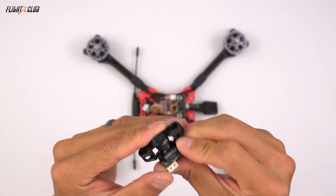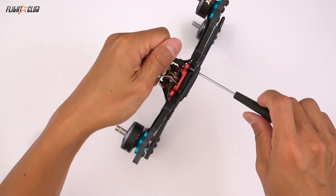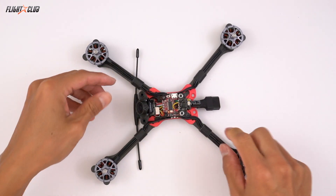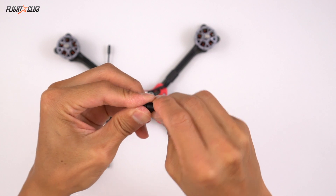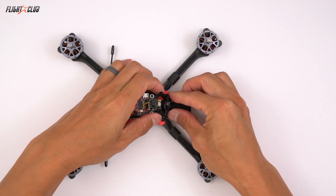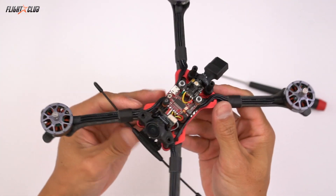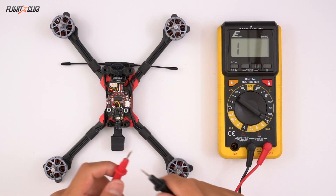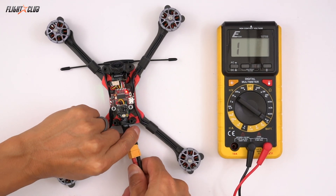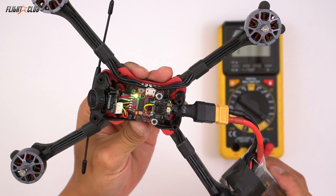Next, I'm just going to install the camera. I'm using a fixed angle camera mount, which makes it so much easier to fly consistently because you never have to worry about where your camera is pointing, no matter how many gates you hit. I designed a little mount to hold the capacitor on this frame. I used to install my caps at the battery lead, but that makes the battery lead really fat and prone to getting hit by the props. Mounting it on the frame eliminates the problem of the capacitor getting hit by the props. At this point we're pretty much done with the build. I'm using a multimeter with the continuity setting to make sure we don't have any obvious shorts. When I plugged it up, I did get the full chimes, but the VTX didn't turn on because we haven't assigned the pit switch yet, which we'll do in the next video.